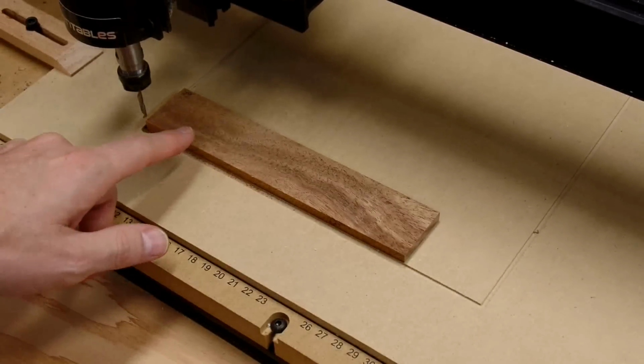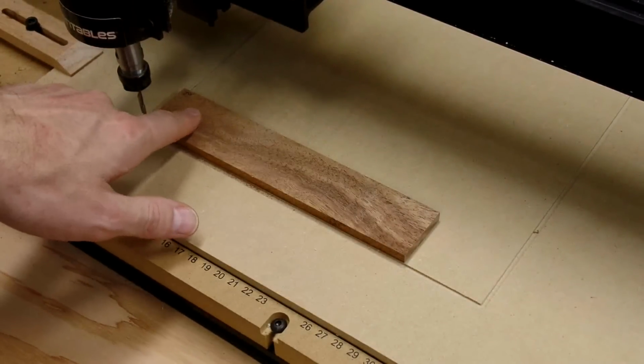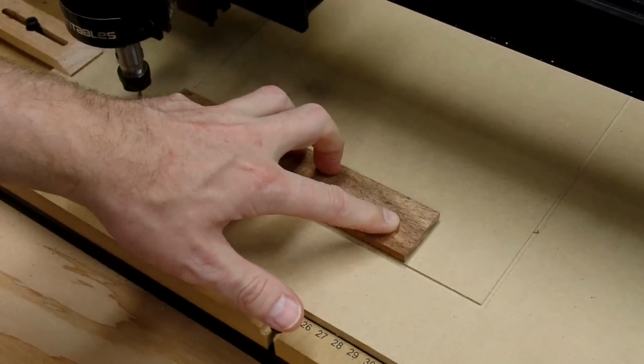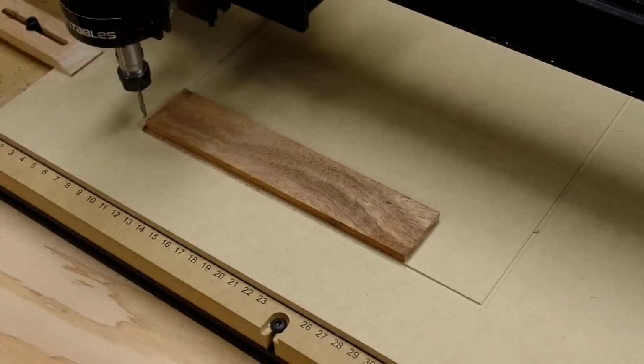And actually, the wire off of the LEDs that we're using comes off a little bit diagonal, so I actually made the exit hole for the wire come off diagonally as well. So again, watch the design based on exactly the material and the equipment that you are using for your sign. You'll have to make some adjustments.